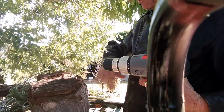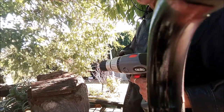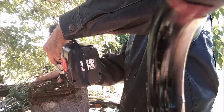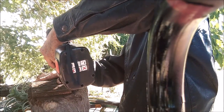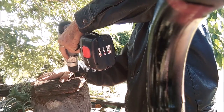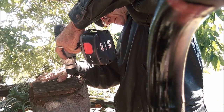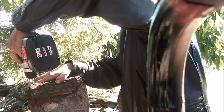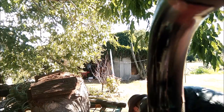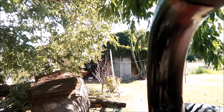It's just a case of putting a piece of timber on the back here — a bit of old hardwood, something that'll last in the moisture. You're best off drilling the holes; I've already pre-drilled these, but just to show you what I mean, straight in, gives you a bit of a guide and it stops the timber from splitting as well. Just clean them out a bit more and we'll drive a few nails in there to hold that on.